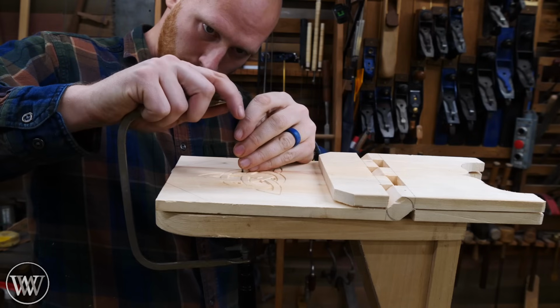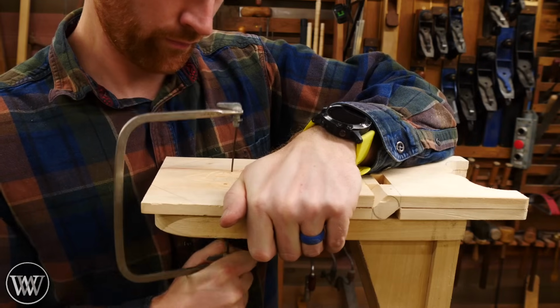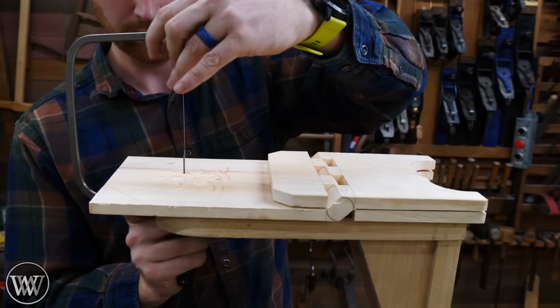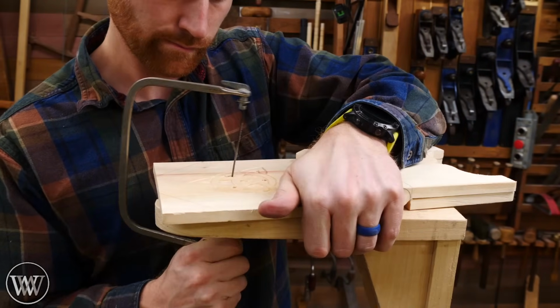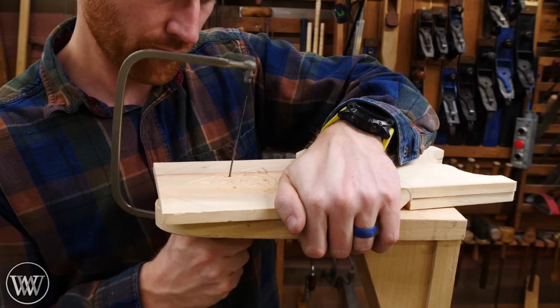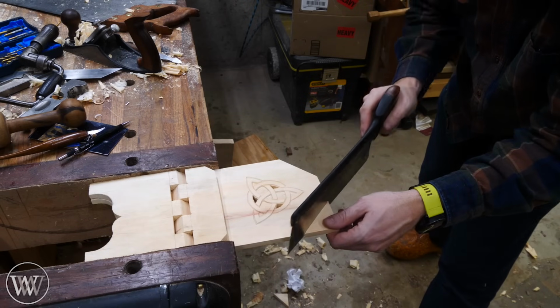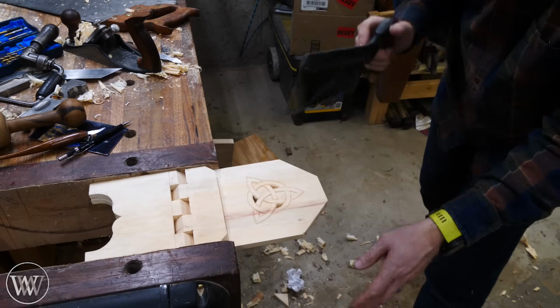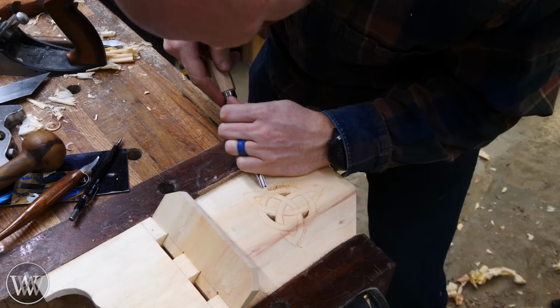And I hadn't decided at this point, so I started working on the fretwork. Now that I had those holes drilled through, I could use the fret saw to clean them all out and get them to the shape of the carving inside. This actually goes really quickly, as box elder is very easy to cut, and with it only being about 3/8 inch thick, it cuts pretty easily. I also decided to cut these at 45. I was thinking about doing another OG, but I think with the Celtic look, I like the 45 on there.